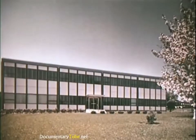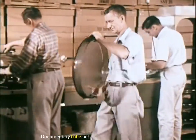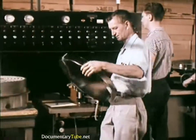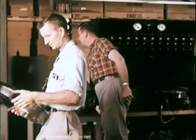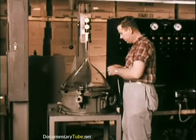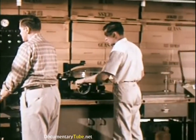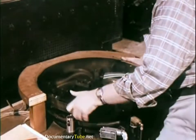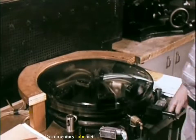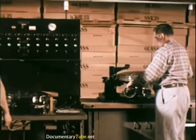In Lancaster, Pennsylvania, color kinescopes are produced with the same cautious guarding of quality. Typical of Lancaster's painstaking controls is the incoming inspection of kinescope glass faceplates and funnels. In a series of 54 checks, critical dimensions are measured within thousandths of an inch to make certain that when assembled with electrical components, each tube can deliver the peak picture performance built into the design. This electric pneumatic contour gauge checks the inner surface of faceplates to make certain they are sections of a sphere, checking 15 gauging points in one simultaneous operation.